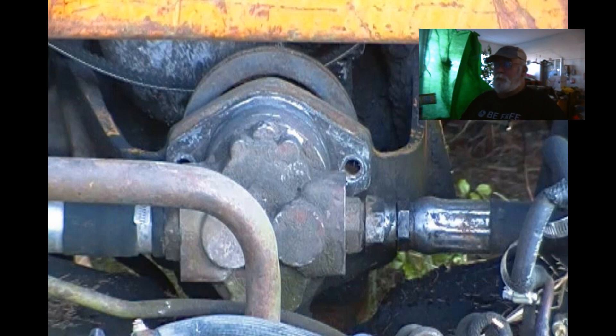A few things I want to point out to you: in this video, the wind is blowing so much and it's really difficult to see what I'm doing. Looking at this picture, let me explain what's going on. The hydraulic pump is that item right dead center. You can see I've already pulled the two mounting bolts, so the bolts are out to allow the hydraulic pump to slide forward, but it's not going to come forward until we take loose that high pressure line on the right-hand side.